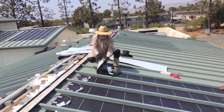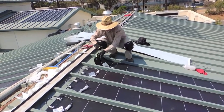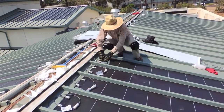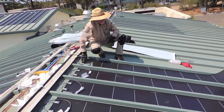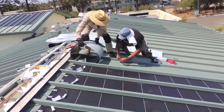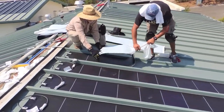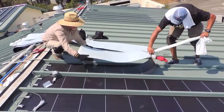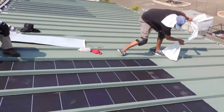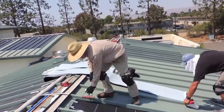Then I'm picking it up and I'll peel back the first few inches of the backing paper, lay it back down flat, and make sure it's adhered at the top. He rolls it up towards me until he gets to the backing strip, and then we roll it back down. Then I'm going to use this roller and go side to side to get all the air bubbles out.